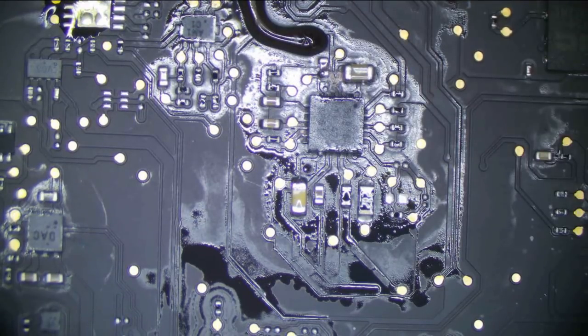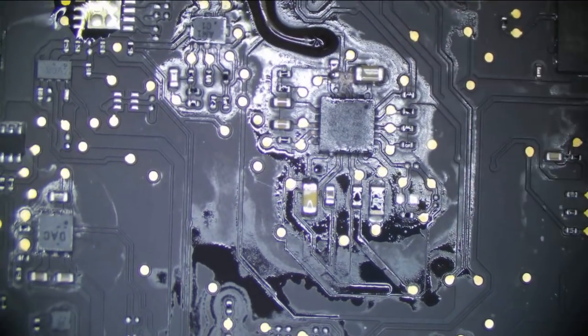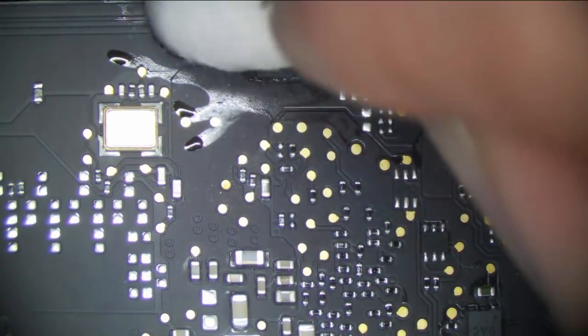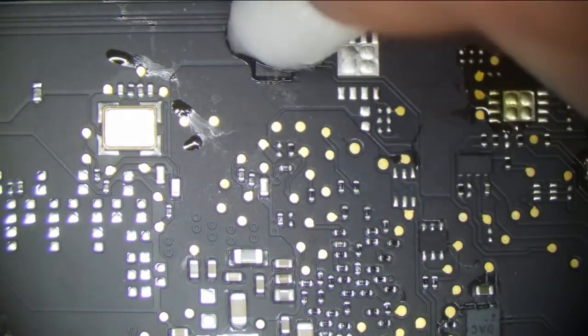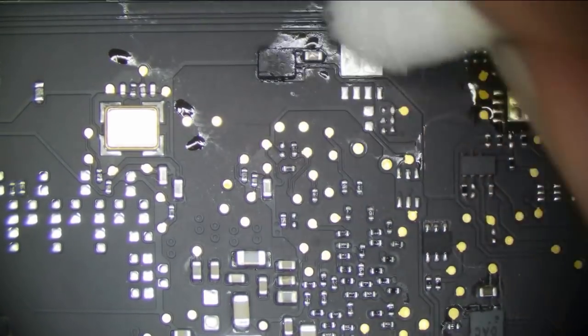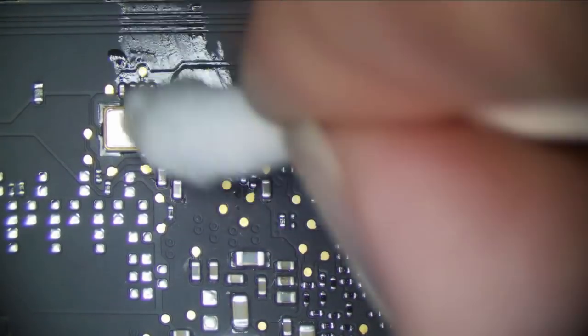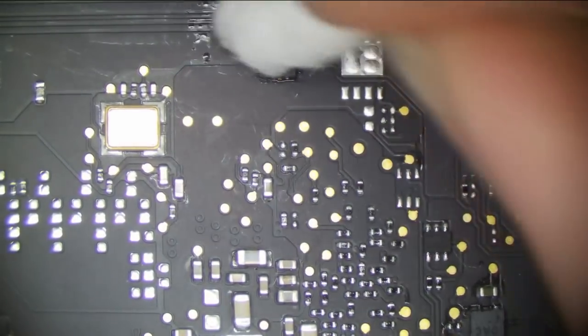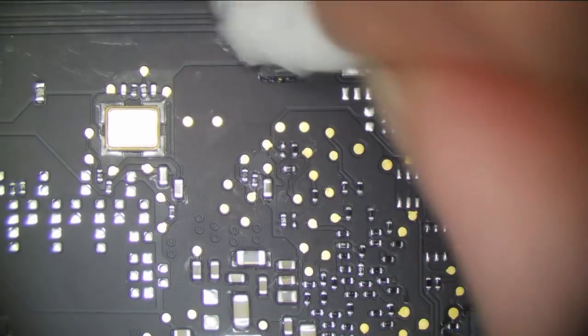That's still way too low. 129 ohms is still way too low, but my guess is that because that chip is burning hot, the resistance is going to be low. That's why it's best not to turn stuff on when it's burning hot. Unless there was something else partially shorted on this line.